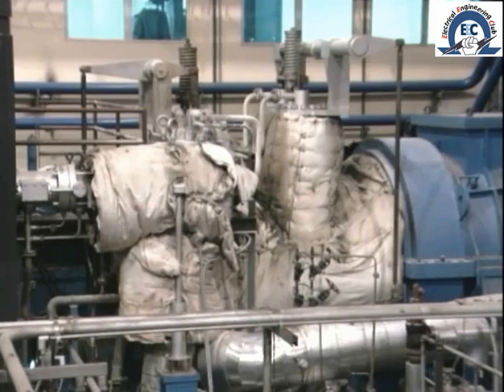The exterior of the turbine casing must be very well insulated to prevent heat loss. With temperatures at the high-pressure end in the region of 1,000 degrees Fahrenheit, we could suffer a considerable loss of efficiency as well as an uncomfortable turbine room if the insulation was inadequate. In this segment, we've looked at general features of turbine construction. Using this information as a guide, make sure that you check and learn the structural features of your own turbines. At this point, it's time for a break, so please switch off the tape now and review this material in your workbook.